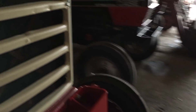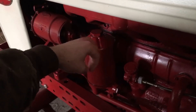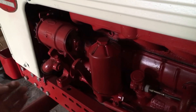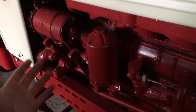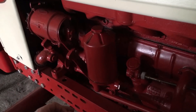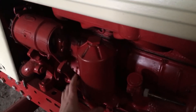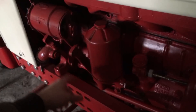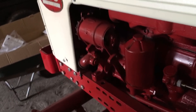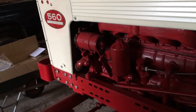Somebody had just commented on the oil filter cups. Steiner Tractor Parts makes an updated spin-on version so you don't need the old cup style — it can be a pain to change those. I know some guys want it original from the factory, and I understand that, but I ordered the modern update kit to put on a modern spin-on oil filter. I see that on a lot of 706s and 656s. Right now this ring up here is leaking, and even the O-ring is leaking — I did the O-ring twice and it's still oozing out. So I got the spin-on conversion kit from Steiner Tractor Parts.